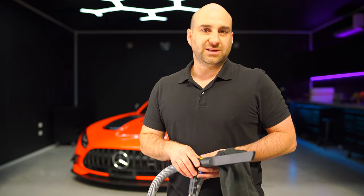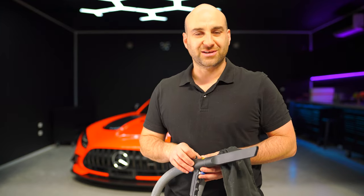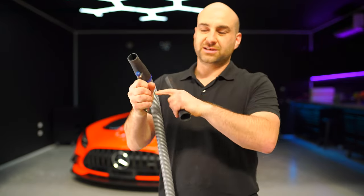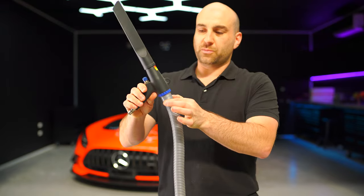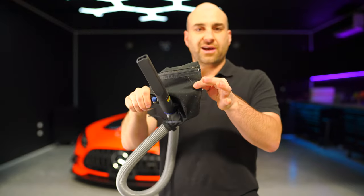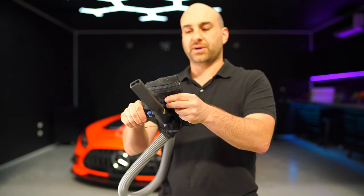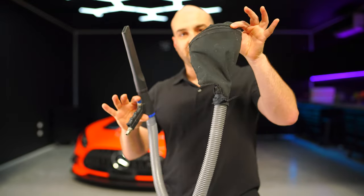One of the things he was surprised about: I said you can vacuum your car with an air compressor. He said 'what, vacuum my car?' and I said yes — you use a tool like this that uses a venturi effect and it basically gives you suction. What you pick up goes through this hose. The air comes out of this bag which is full of small holes, but the debris can't pass through the bag, so the debris stays in the bag and you catch what you vacuum.